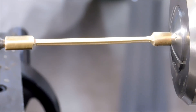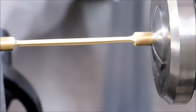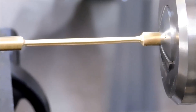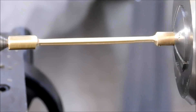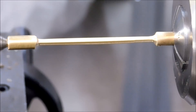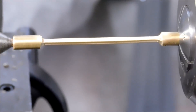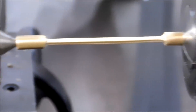This is now set up in the lathe and I'm going to use 20 gauge brass wire to do this. I'm going to thread it through the cross hole that we put in the arbor in the first place, turn the machine on incredibly slow, and let it coil around that rectangular cross section that we just formed in the mill. Now realize that this is not a good idea if you're on an incredibly high speed on your lathe — that six foot worth of brass wire hanging out is a giant weed whacker and can do a considerable amount of damage. Confirm that your machine is in the slowest possible speed and that there are no loops or hooks formed in the wire. Please be careful when you try it.